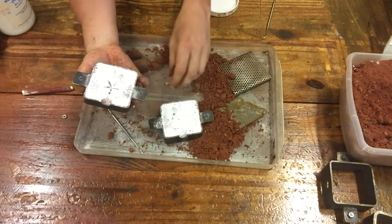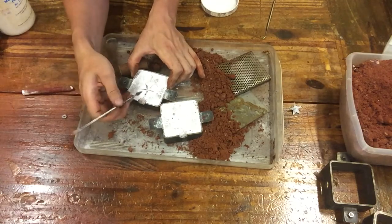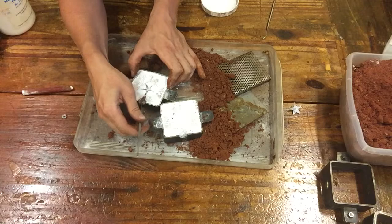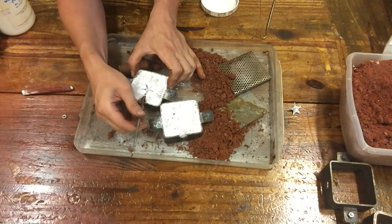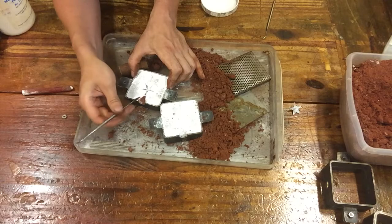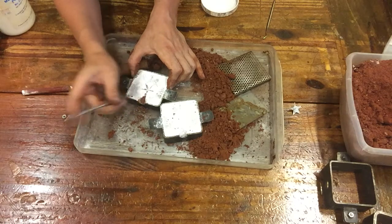And so at this point, if you want to do anything else, all you need to do is take your part and carve out the gate so metal flows directly to your part. And the trick here is you want to sweep away from your part so no excess sand falls in to your final part, right? You want to make sure that there's enough of an opening for the metal to flow all the way through your part, okay?